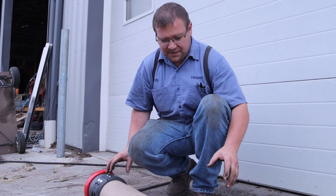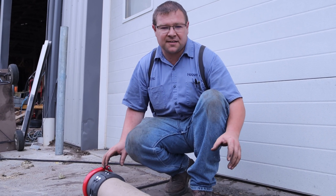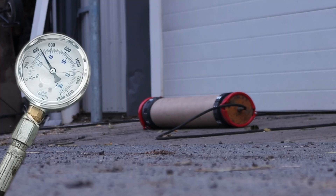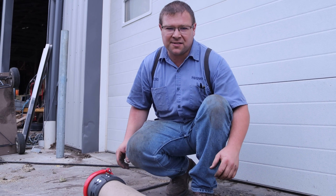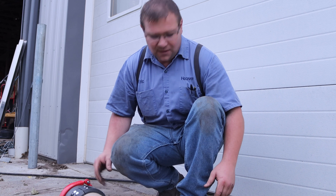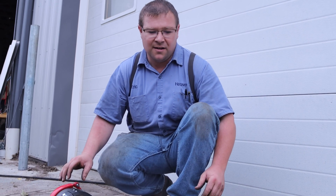Here is a piece of six inch hose that we're going to pressure test. This is army surplus hose — what pressure can it really handle? Normally it's a three to one ratio, so if they say it's a 200 psi working pressure, that means it should be a 600 burst.